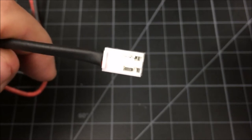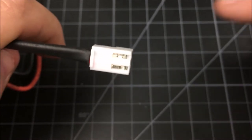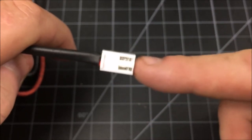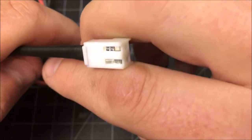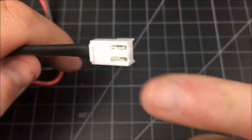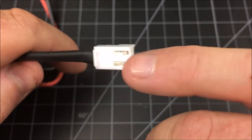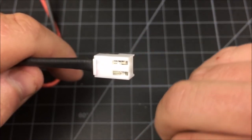I found a little quality problem when I was trying to get things set up. If you look at the terminals here on this top one, it's not snapped in all the way. When you go to push it into the controller box, it's really hard to see, but the fins need to lock in and lock the connector into the actual plastic housing. So I've got to push this in, or take the metal piece out, bend up the fins, and try to snap it back in place.